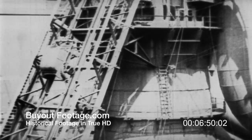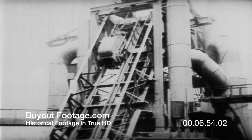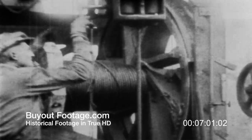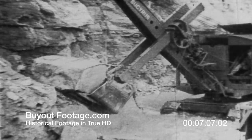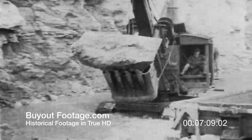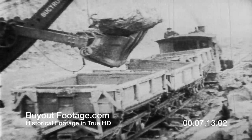Likewise do skip hoists for steel blast furnaces. Then there's resilience and tension factors in repeated stress of oil well drilling, yanking this rope millions of times before it's worn out. Wire rope must be able to resist shock or impact in serving the construction industries. Digging a rock out of the earth may put a stress on the wire rope many times greater than that of lifting it.